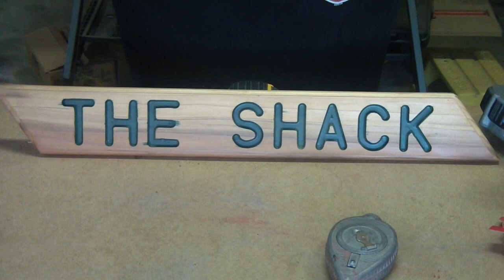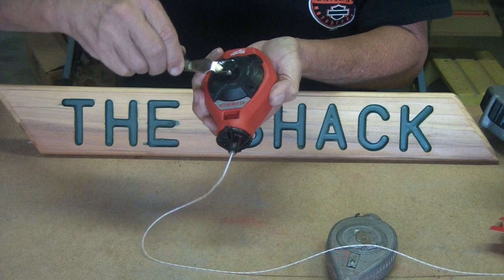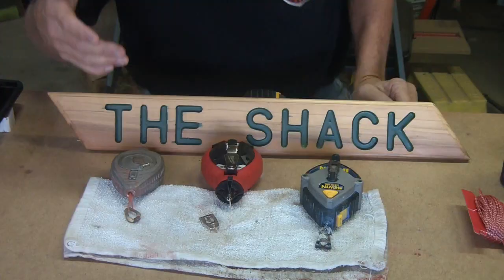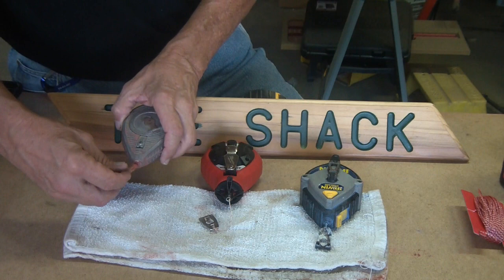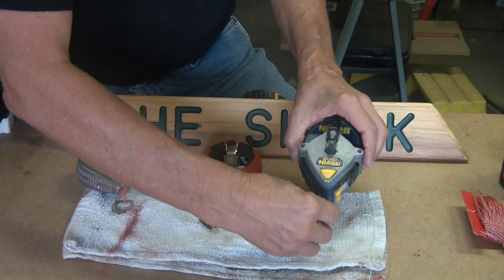I'm going to crank this out. This board I'm sitting here at is three feet. I'm going to pull that out — okay, that's 36 inches already lined out. I'm going to put this up in the center and crank one full crank. I've done this multiple times and I average 34 inches per crank. I put a rag down because I'm going to pull some of the line out. You can see how much chalk comes out on that old style vintage — a lot of chalk drops everywhere. Very, very messy.